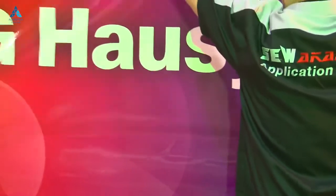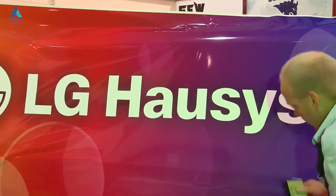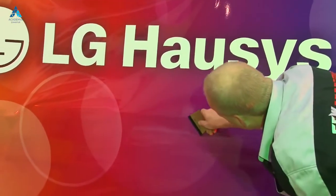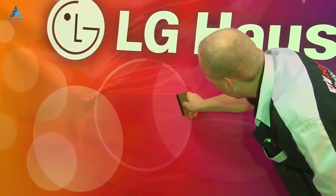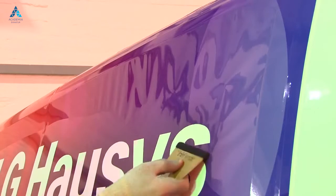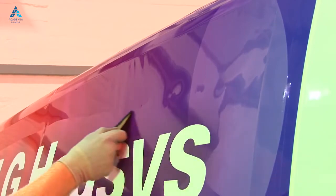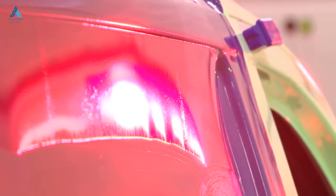When gluing particular areas, the following steps must be adhered to. First of all, glue the film entirely over the seam. Warm and blow the film where the seam occurs at the highest point. The optimum range of temperature for laying the film in the seam is between 50 and 60 degrees Celsius. You can tell this is the case by a puckering and then smoothing of the film.